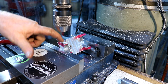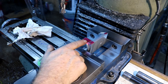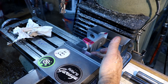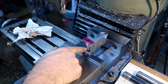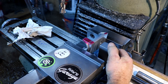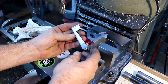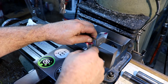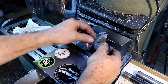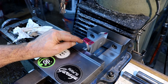Now we'll flip it over and do the same on the other side because it's the same angle, and then we'll do the other end. This is the other end — it's set up at 96 degrees, so it's six degrees off to that side. Down here I have a thick parallel clamping on this surface, not on the cam, and the back jaw. I took a 1-2-3 block and a six degree angle block — I made a whole set of these out of stainless. I set that on there, held it up against the angle block and set the angle. This is not a super precision angle, so we're just going to mill down to a scribe line.